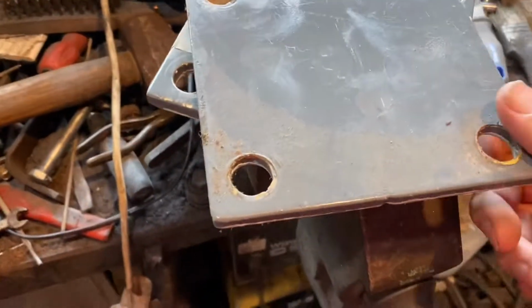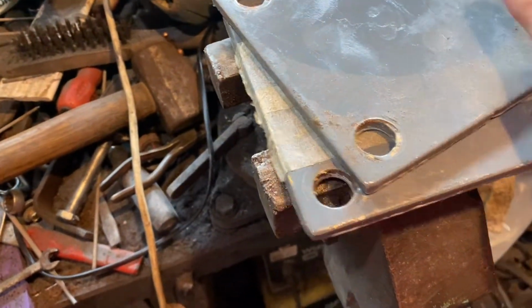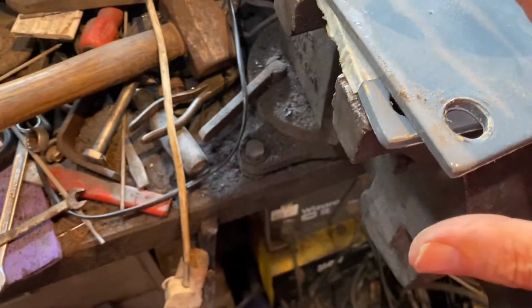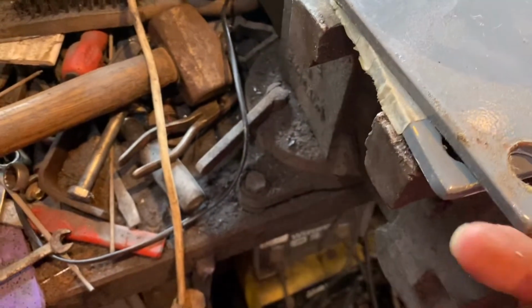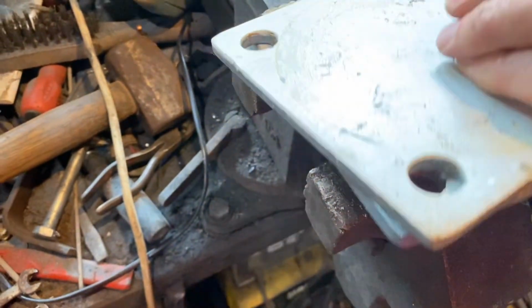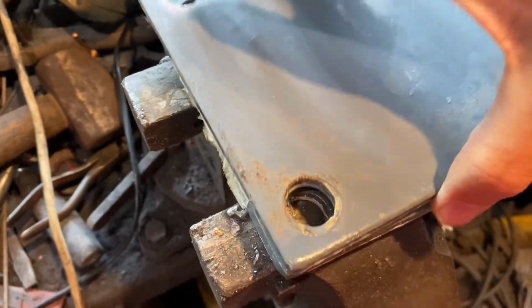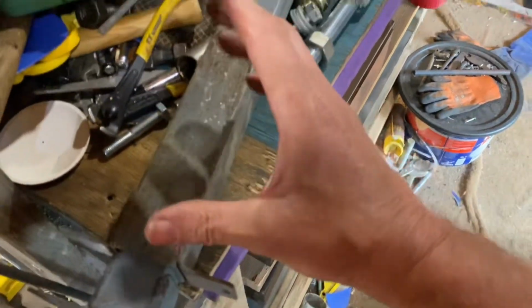Well, I was mooching about. We've got the jaws. These are blanking plates. The thing is, in these vices, you don't realize how thick and how strong these jaws are. But anyway, they should be strong enough and thick enough. We'll get them to close. So we'll put the first one and we'll weld above it, and we'll put the bottom one in and we'll weld below that one. So these two faces, as long as we can get them to clamp together, will do what they've got to do. So basically, it's just a case of building a thread in there.